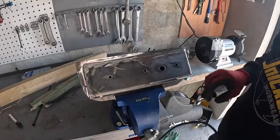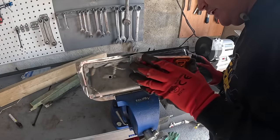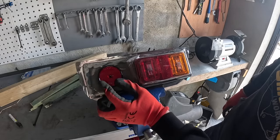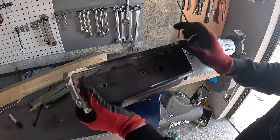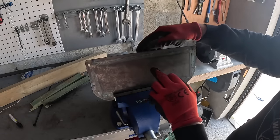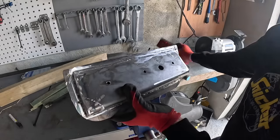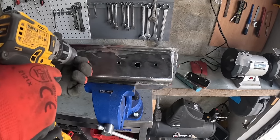This is our face plate now. I'll run the wire in here and stick on our new LED light. Let me get our reflector — it sits there — and that should be our new unit finished. One thing I also have to do is gain access to tighten the two nuts, and the same with the reflector, so I'm going to drill two holes here so you can get in a wrench and tighten from behind. If you're going to change the light, you take this off first and do it all from this side. Best way to drill the holes is just drill straight through.